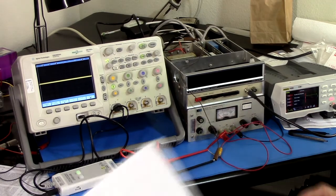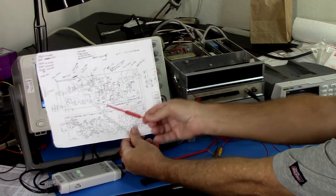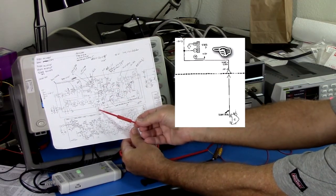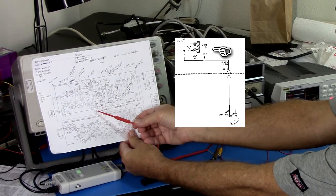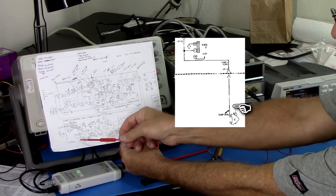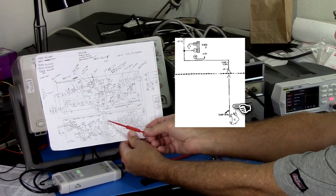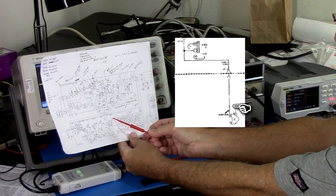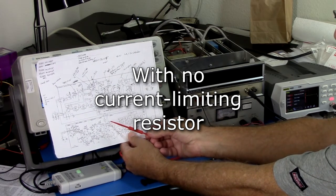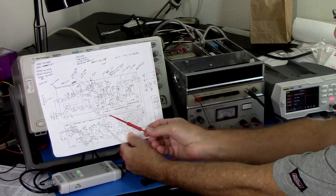Okay, there is one potential issue, and that is that this is the multiplier board, and this is the switch that switches between ground and +5. And there is one feed to an input here on the input board. It's just a logic signal to an ECL gate. That's IC-404. So that could be the problem rather than something on this board.